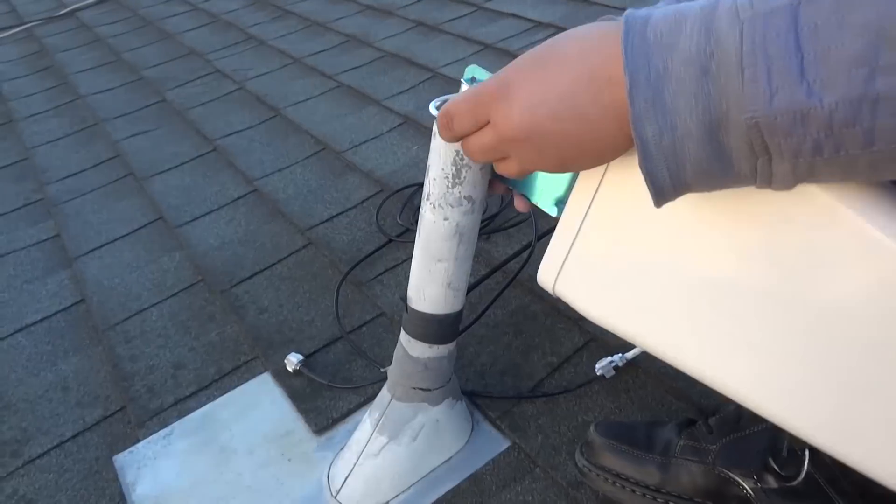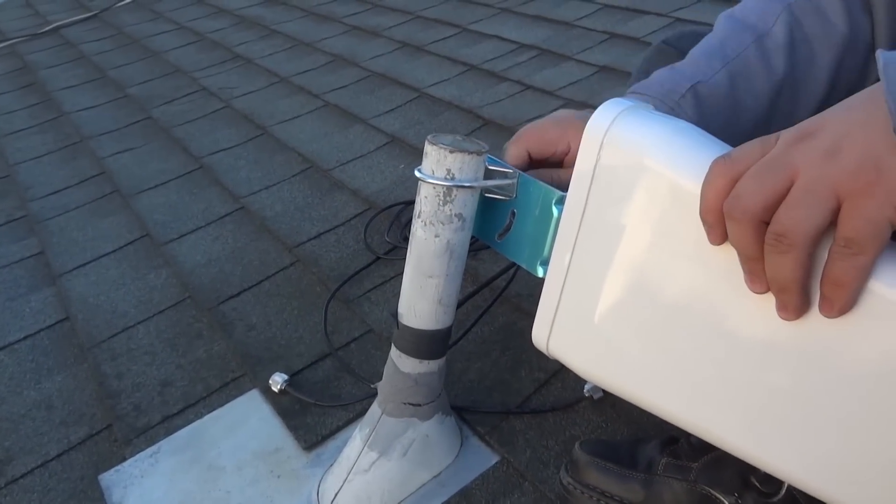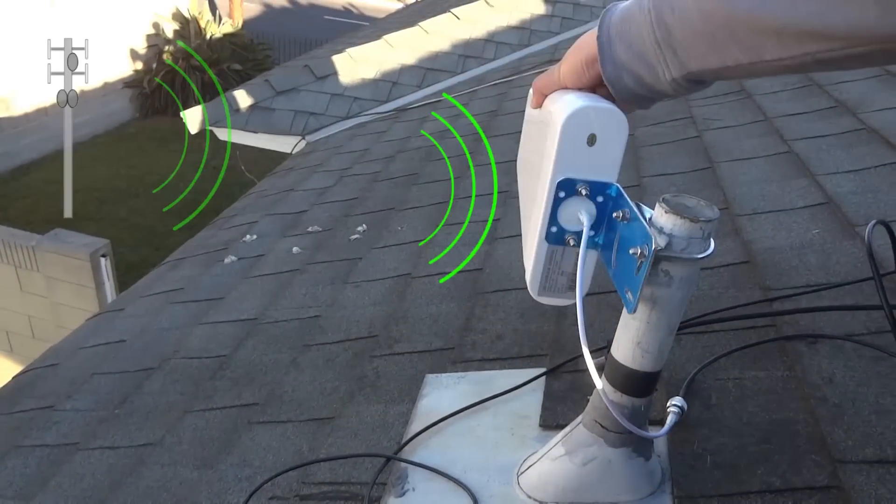I have determined this is the best location to install the outdoor antenna. The outdoor antenna needs to be installed as high as possible, and it has to be at least two meters apart from the indoor antenna vertically. Therefore, I'm going to install it on the roof. It is better that you find a pole-like object to attach the antenna. Position it so that the side of the antenna faces the signal source, the direction where the signal comes in the strongest.